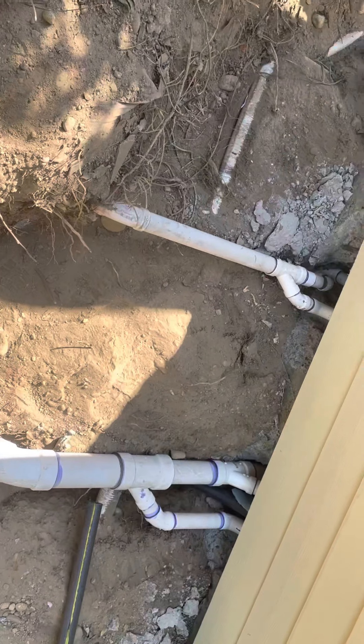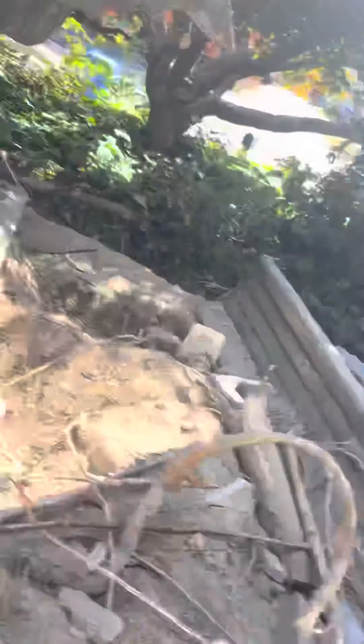And there's no reason why they can't get 2%. And then bury that 18 inches deep minimum. Come down, and then you can bring this line — this could be a four up to here. Four come together. This has to be a four. Four together. And they've got plenty of fall to get this 18 inches deep, so they can catch it way down there. I know the piping's out far enough. Minimum 30 inches.